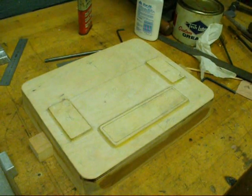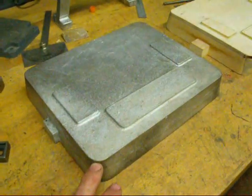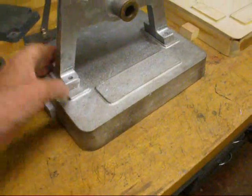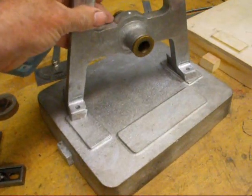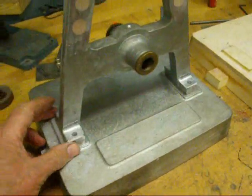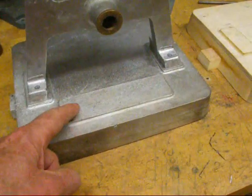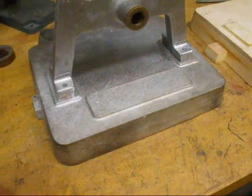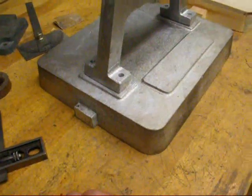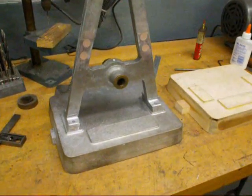It is rather gratifying to see your pattern go from wood to aluminum casting. The engine itself will sit upon these bosses — so now you can see what those are for. They just raise it up and define the space where it's going to be bolted on. The next thing I'm going to do is mill out the well here for the flywheel, then take off the gates, sand it just a little bit, and we are sure nearing completion, finally.